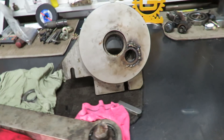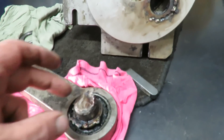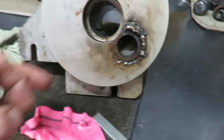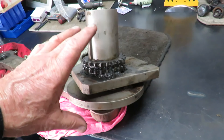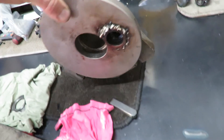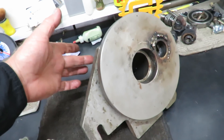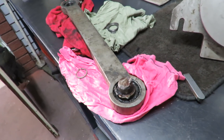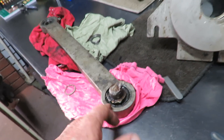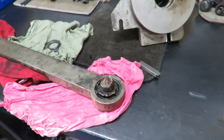So I went there and I saw what the problem was. This crank arm shaft has broken away. Somebody's tried to weld it in the past, but really, as you can see here, that was the inner weld inside there. This sleeve slides onto the gearbox and this plate holds it in place so it doesn't float backwards and forwards. There's other chain gears that go on there as well, and this oscillates and operates this arm which moves part of the pasta machine backwards and forwards.